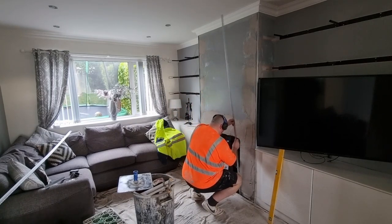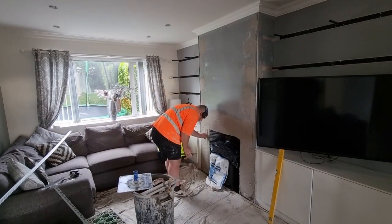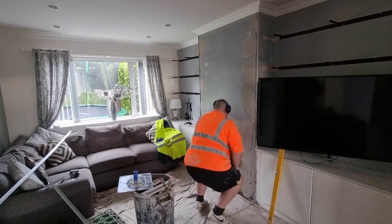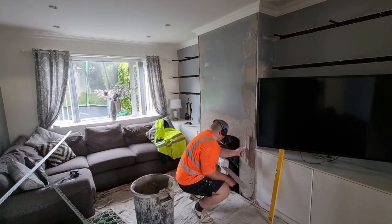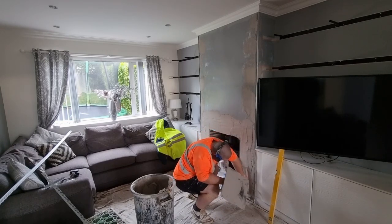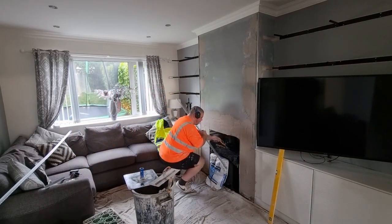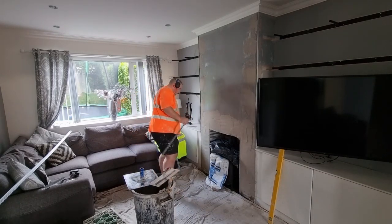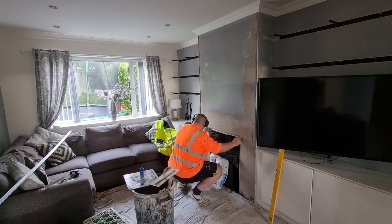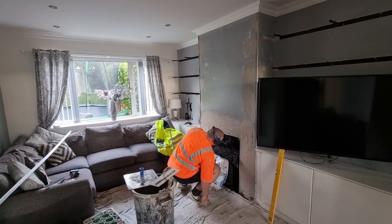So when I am doing these what I will do is I will do the two legs first and then I will cut my top bead to match in. You can see there I just checked to make sure they were similar heights. I put a level on just before I filmed so I knew the tails were level, so I knew both legs could be cut the same. And then as you can see, I am just cutting the last bit for the head bead, and that just lines up to the edge of both beads and keeps it nice and level.